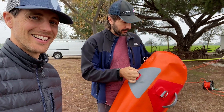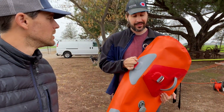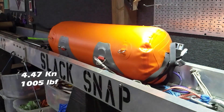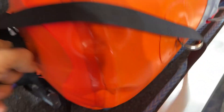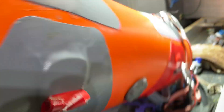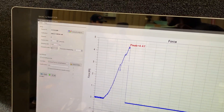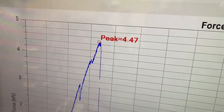The thing I'm really curious about is what is going to be the failure point — how much is it going to take to tear these things off? It's not the same shape as a D anymore. Wow, that just tore right through that. This stuff looks stronger than it really is. It took a thousand pounds — 4.4 kN is a thousand pounds. It started to tear right here and then went straight down after that.